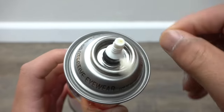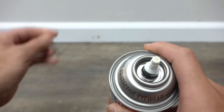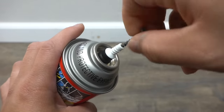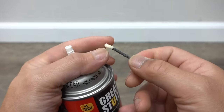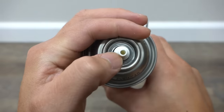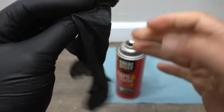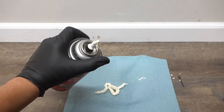If you look at this can, there's a little bit of foam coming out of the tip — if you tear the top it's still going to be clogged, but there's more foam right underneath. Take a drywall screw and insert it — you'll start hearing a little popping noise — then pull it out and you'll take out that mass that's stuck inside. Look inside and it should be nice and clear. Since spray foam gets very messy and hard to get off your hands, I'm going to use some gloves for this.